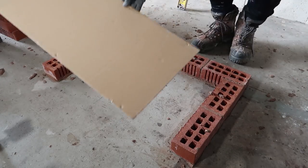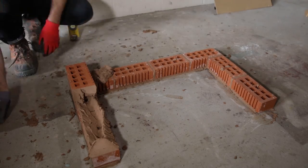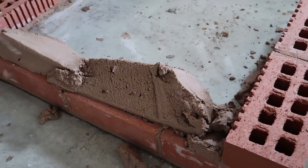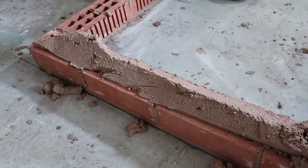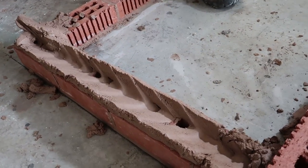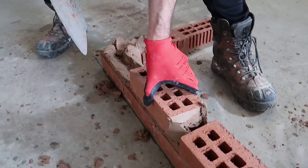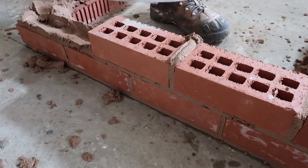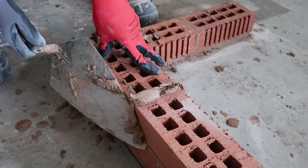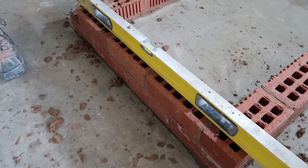I'm going to put it on the side here now and spread through here. Get the back of your trowel and try to get a nice uniform bed; scrape off any excess. Just gently tap that, holding your back brick so you don't push it out. Push it into place — nice and full on your joint. Scrape off any excess, back on the board, set it up again. Just a little touch, and that's it — that's what I'm looking for every time.